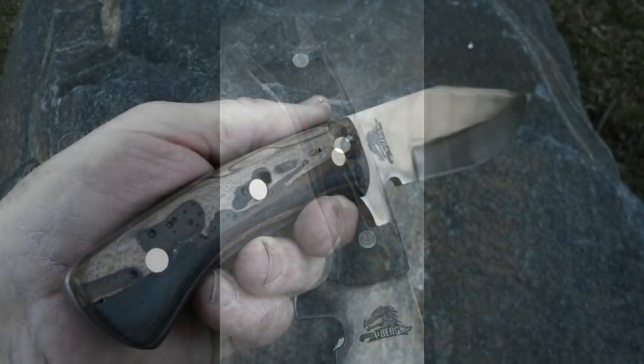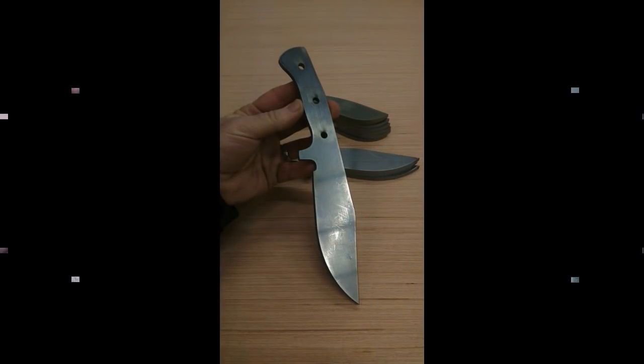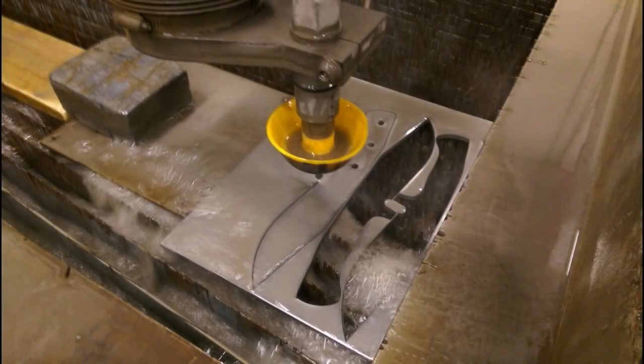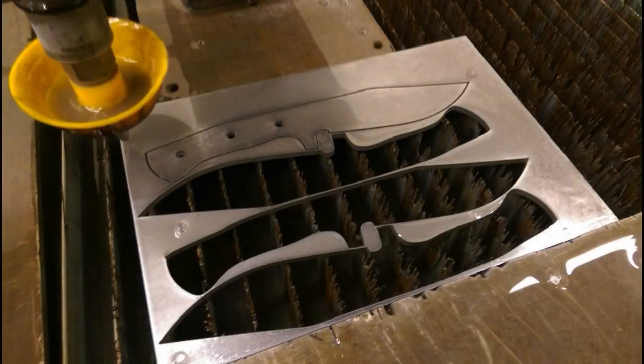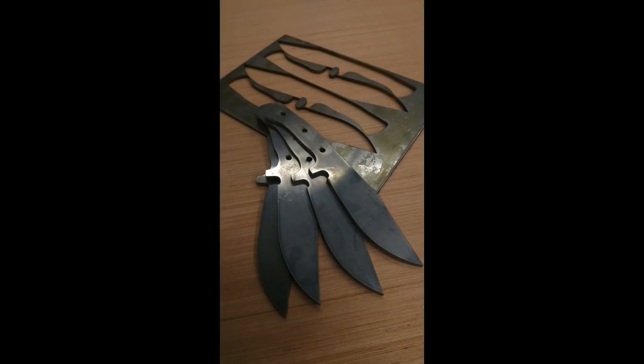This particular knife started out as a knife blank — I have this particular style in stock. The blanks were cut by a water jet company here on Long Island, New York, called Long Island Water Jet. They did a great job. The blanks are all cut out of 1095 high carbon steel, they're 3/16ths thick, and they were designed to be a little bit flexible in their design so individual knife makers can grind down the bevels differently.